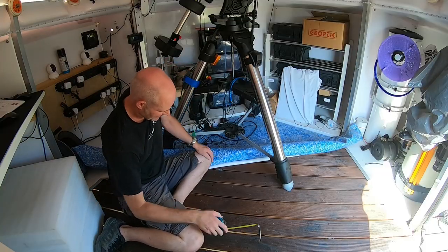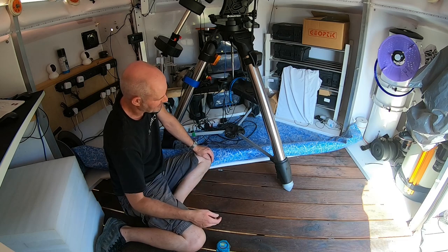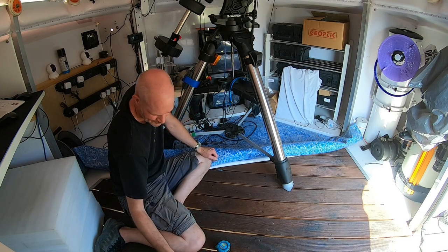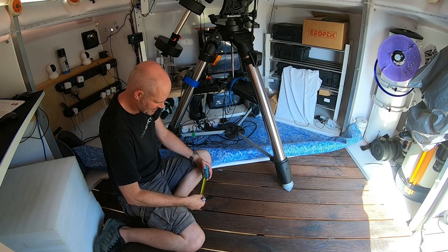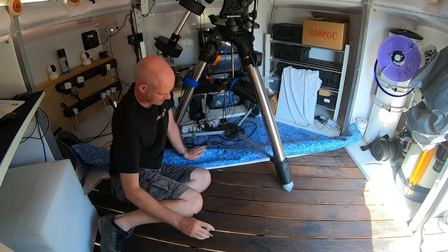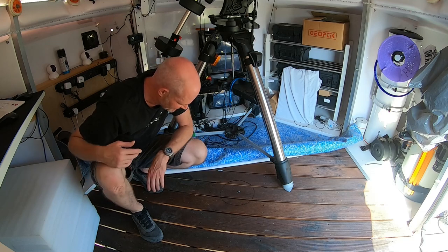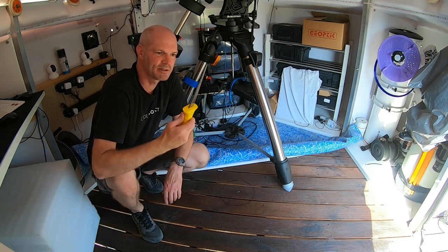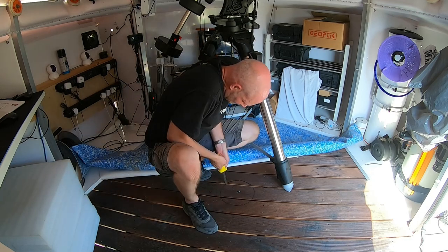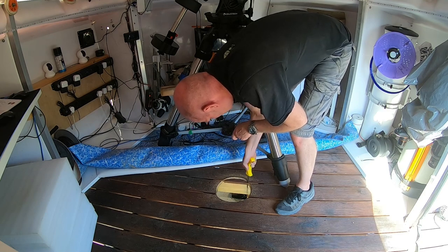Back in the dome - here's the center of the dome. I've pulled the swimming pool liner flooring out of the way and shimmied the tripod aside. The pipe itself is 200 millimeters external diameter and I want to give myself about a centimeter clearance, so I'll mark that on the floor. Unfortunately I don't have a jigsaw here in Cyprus and I'm not going to buy one just for this, so I'll attempt to cut it with what I have. If that doesn't work, I'll just hack it out until I get down to the size I need. It comes out reasonably round.